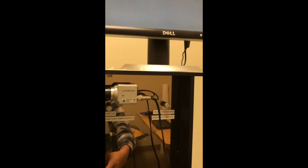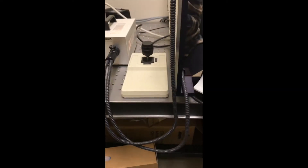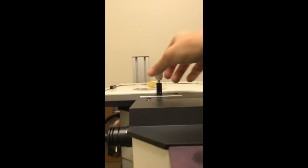Now that we're almost near focused, there are a couple of important things to note. When you get close to focus on the silica sample, you'll see an image — but this is not actually the sample, you have to go a little bit farther. Once you keep focusing, this is actually where you want to be. You might see a couple of little scratches or dark spots, but the way you know you're at the right spot is with this joystick — it moves the stage. When you move the stage, you should see the sample move. The fact that you can see the movement means you are in fact on the sample. Now that we know we're focused, we don't need the camera anymore — if it's in there while you're trying to run a sample it'll get in the way of the laser. So go ahead and pull the camera up gently, lock it, and we'll turn the light source off.